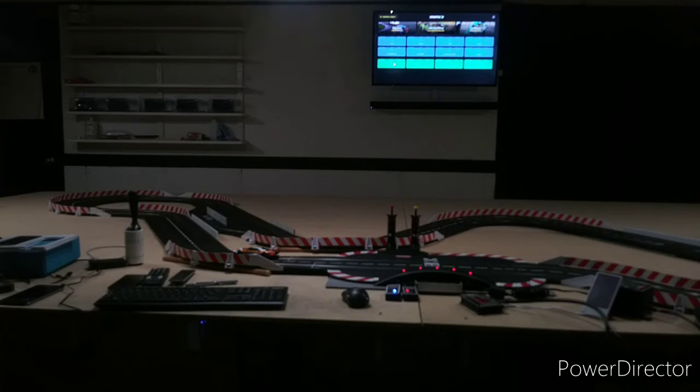Okay, I just went ahead and turned everything off and back on again, and I was still able to reconnect simply by cycling the location settings. So it's obvious I'm going to need a different version of Android, and they have several builds available at the website for Khadas. So flashing a new Android image onto this board is not difficult. So I'm going to go ahead and tackle that, and we'll continue and see where we go. But before I do that, I'm just going to continue running with what we have here for now and make sure it's stable and everything works.